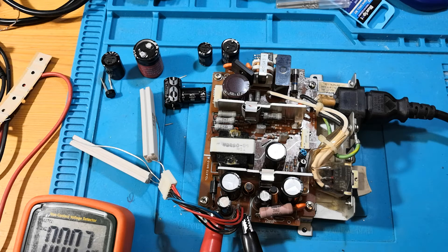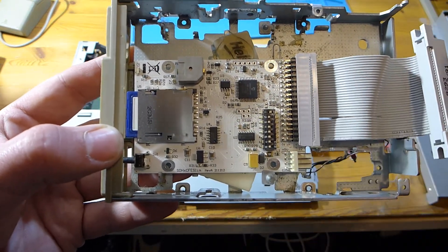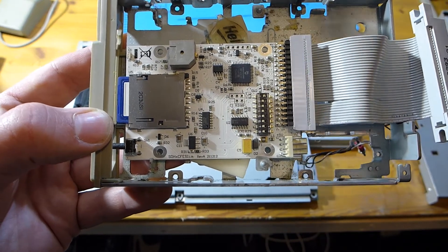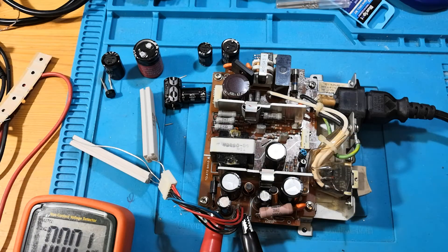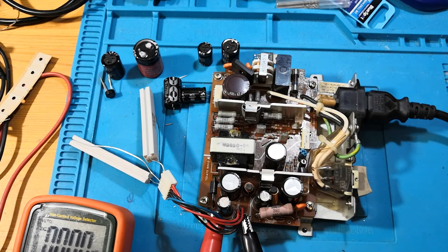I'm not going to power any 12 volt things off this power supply ever again, because I have an HXC 2001 floppy adapter — that's 5 volts — and the rest of the ST I think is 5 volts anyway. There's no weird analog circuitry inside it, I don't think. So this should work quite nicely. To answer my first question of whether this was worth doing — clearly it was, because now everything is giving out the correct voltages.